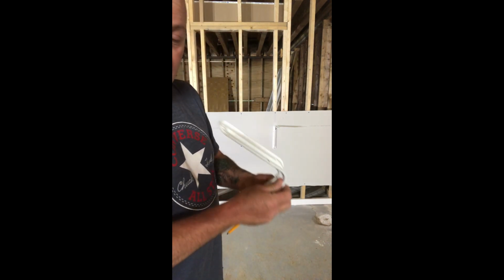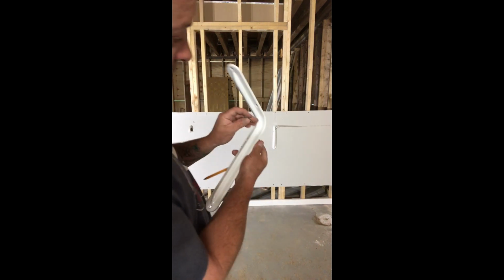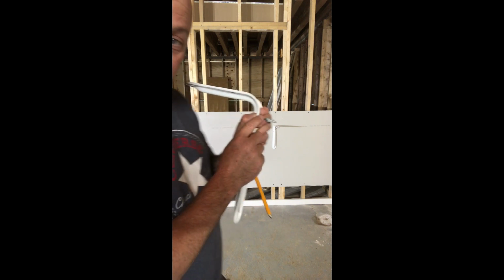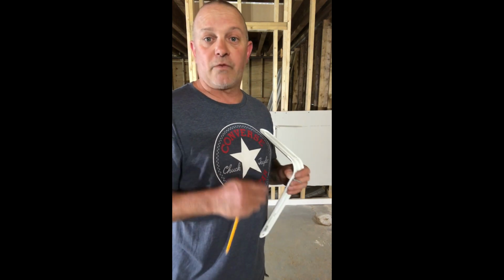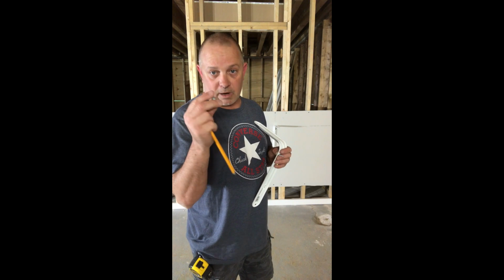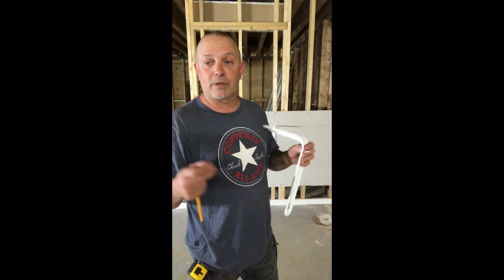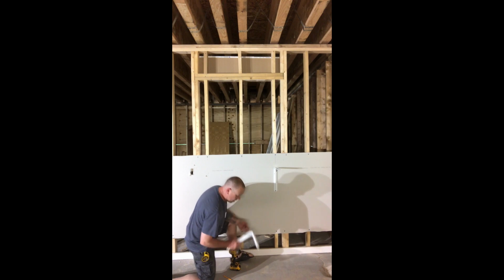And then on the front side, they give you a screw with it. You screw that screw through the shelf bracket, and it goes inside of this anchor, okay? When it goes inside of this anchor, that thing kind of spreads out a little bit, and that's what holds your shelf up. If it's light, like a couple picture frames or knickknacks, fine. But if you wanna put a bunch of books on this thing, this might not be the anchor.